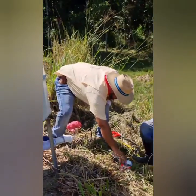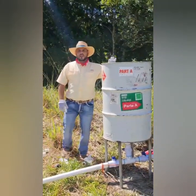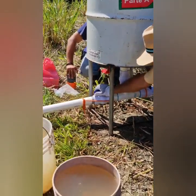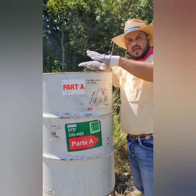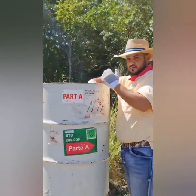Remember that we have to find a point lower than the lagoon to run the test. I am going to fill the barrel to fill the drain pipe. It is making bubbles because we are loading the pipe that feeds from the lagoon. We can see that the key at the bottom of the barrel is open, and the stopcock to the lagoon pipe is opened. We are filling the lagoon pipe.